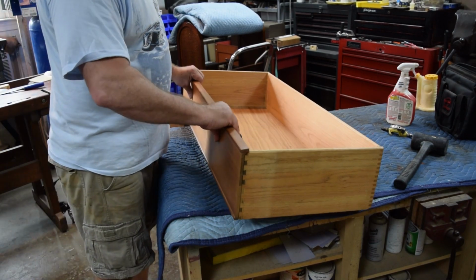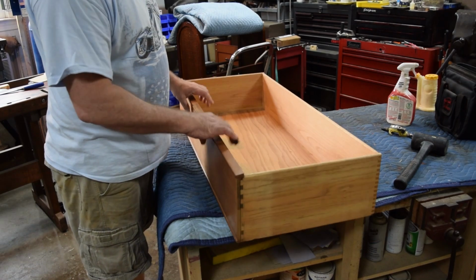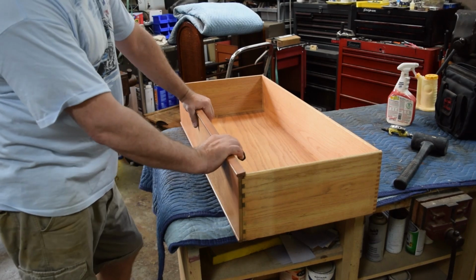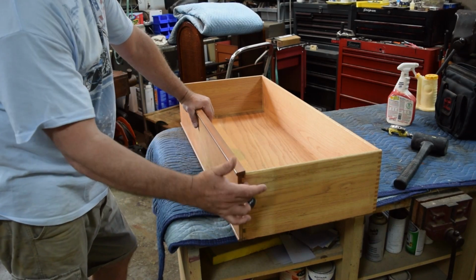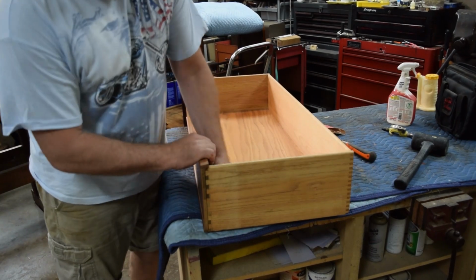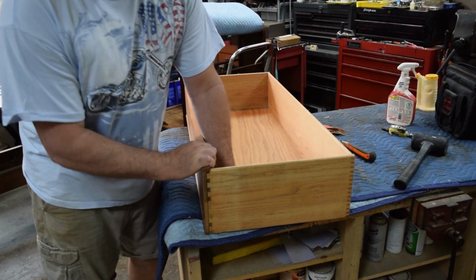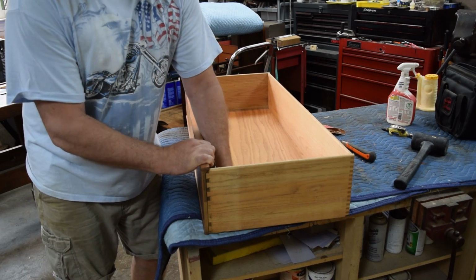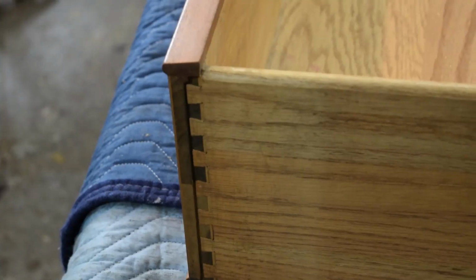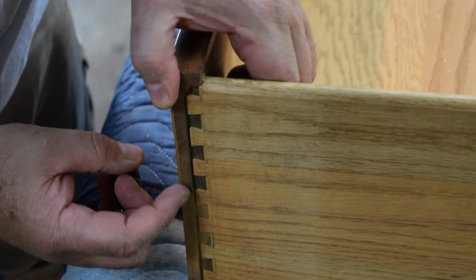if when you put them down, you hear that rattle, that'll tell you something's loose. In general, with a drawer this age and this construction, it's going to be the dovetails letting go. The glue just 70 years old. And maybe you can see as I push this, both sides the dovetails are loose. Let me bring you in. Okay, watch right here. See?